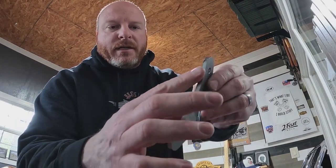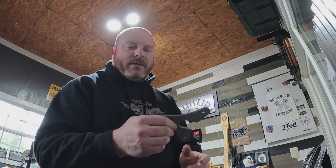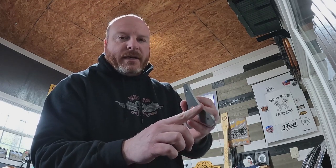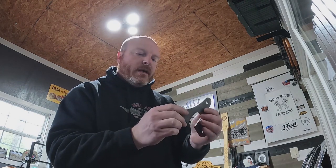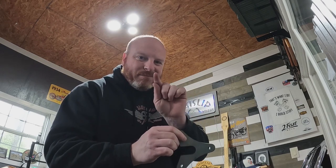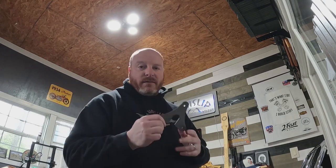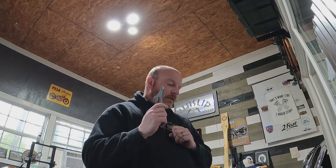What the chamfer table does is — say this is one of the parts you cut out — you're left with a halfway decent edge, but it's still kind of sharp and doesn't feel good in the hand. This tool will chamfer the edge, and it doesn't matter the shape — it can do inside or outside. It cuts that edge at an angle, and you can adjust how deep the chamfer is, whether you just want to barely break the edge or really cut into it. It is adjustable.